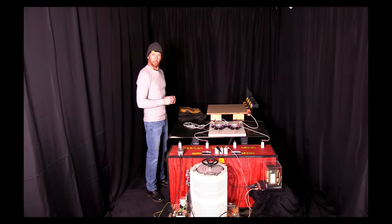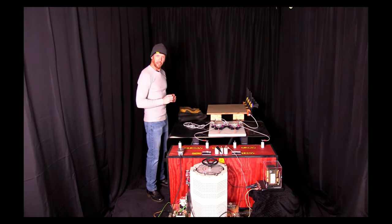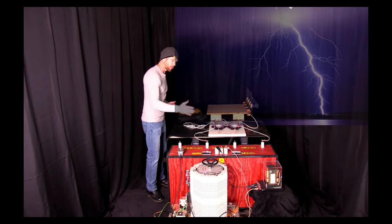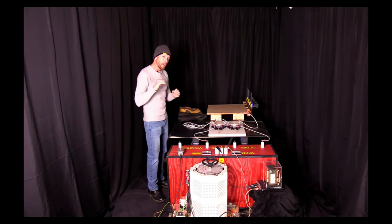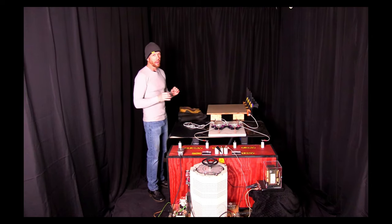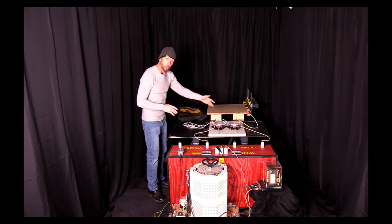I wanted to explore the possibility of creating large-scale Lichtenberg fractals by use of high-voltage DC electricity, just like the kind found in lightning. So for this, I'm going to employ an externally ballasted multi-tap transformer bank. Now the transformer bank should be capable of delivering a minimum of between 7 to 10,000 volts, and ballasting will be accomplished by way of an inductor, the measured value being set at about 200 henries. High voltage current will then be rectified by a full bridge.